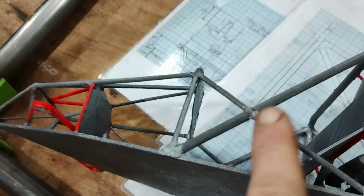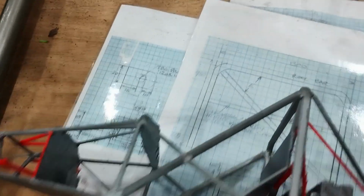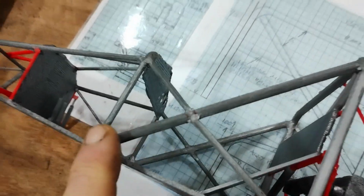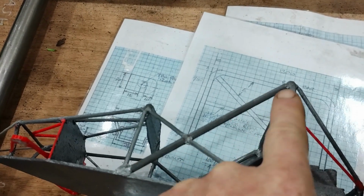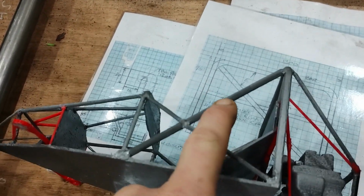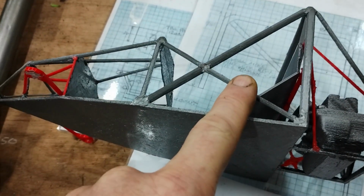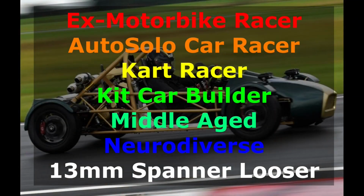Right, so by side braces I'm on about these bits. So this one here, part of the MS UK requirement is the roll bar's 50mm CDS, and this has to have at least one brace. It can either go forward or back, but it has to be one brace of the same 50mm. So that's going to be 50mm, and this is going to be 32. But obviously I do this one first.